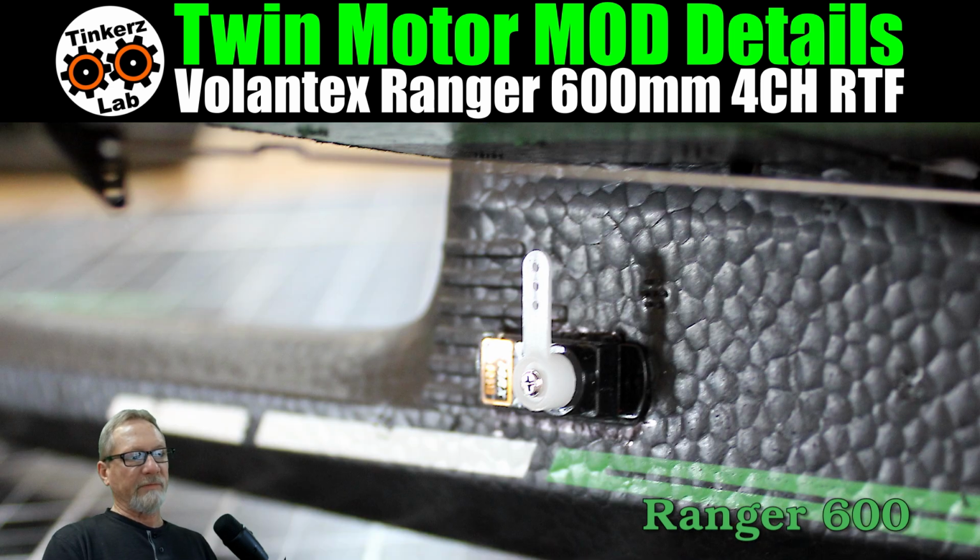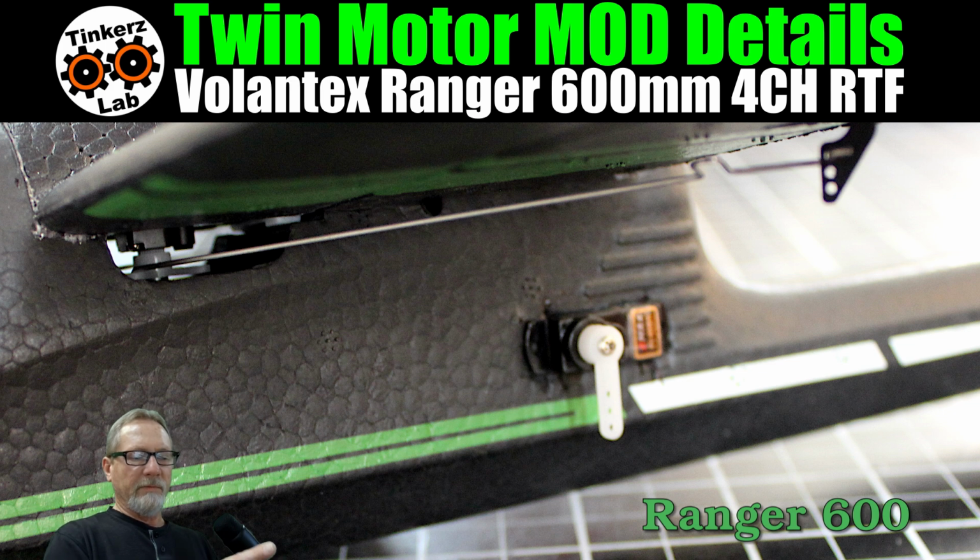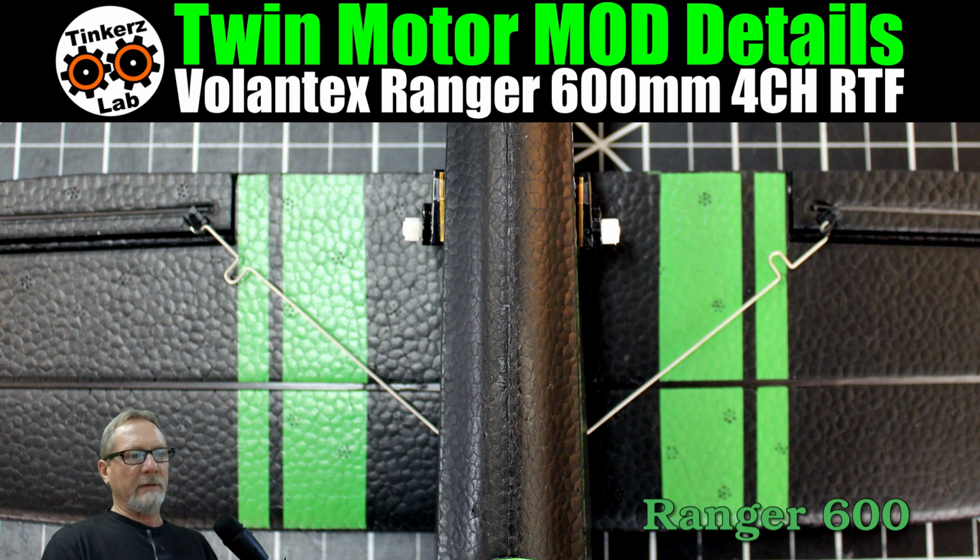All right, so my servos, I've located those vertically within the center position of the horizontal stabilizer. One on one side, one on the other side. This one has the arm facing upward because the control horn for the rudder is above the horizontal stabilizer. And as you'll see, the servo on the elevator side has the control arm facing downward because the control horn for the elevator is below the horizontal stabilizer. And then here's looking at it from the bottom.